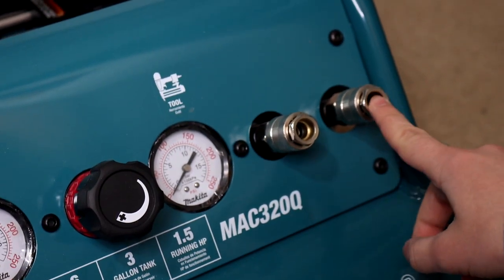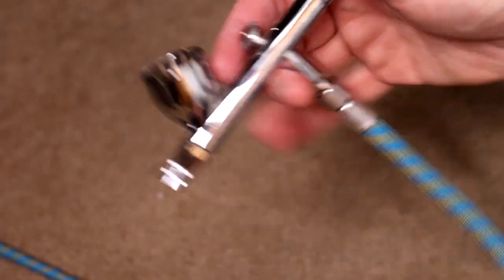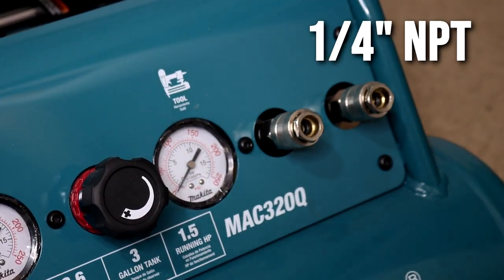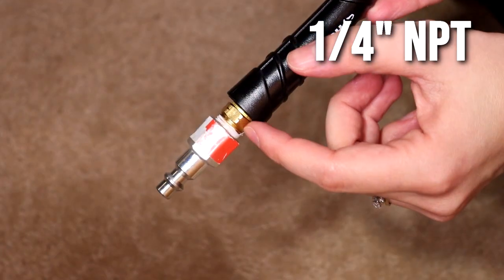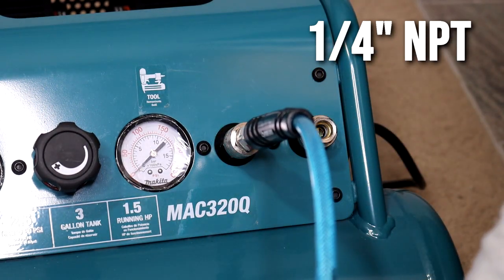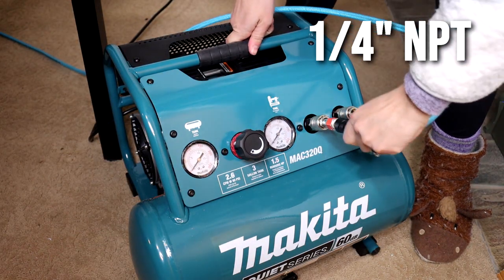For a shop compressor, it's a little more complicated because we are running from those bigger adapters down to the smaller adapters — going from the fitting on the front of the compressor to an airbrush hose. As a general rule of thumb, all of the compressors I recommend in my other video are all one quarter inch adapter. The big fitting on the front of the compressor is a quarter inch quick release, so if you get the male part for that quick release, you're able to connect anything you want into the machine. The quick connect makes it easy to pop tools in and out quickly, and that's standard across most compressors minus the hobbyist ones.